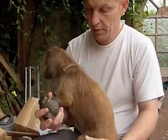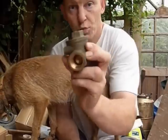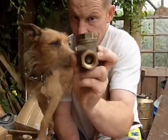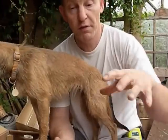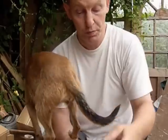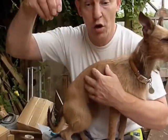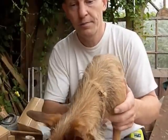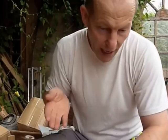Here's a check valve. This is a swing check valve - you can probably see it swinging there. I'm using a valve-style one for the main shut, the main check valve - like an engine valve. It's a ring with a tube sticking out and it just slides up to shut, exactly the same as the valve on an engine. The reason I'm using one of those is because I can weight the top to hold the valve down. The valve itself is quite light, even though it's made of brass. If I can weight it down a bit, it can hold it open longer and then get more energy down the pipe before it shuts and hopefully pump higher.